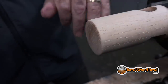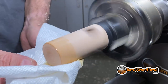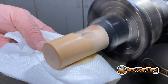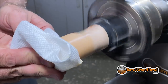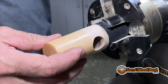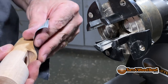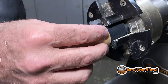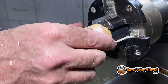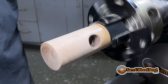I'm going to apply some friction polish to this side of the handle — get the speed up, just wipe a little on, and buff it. It's dry to the touch pretty quickly, which is nice. Then I'm going to pop this out, pull off the gaffer's tape, lightly wrap it around the other side, place it back in, and apply friction polish to the other side of the handle as well.